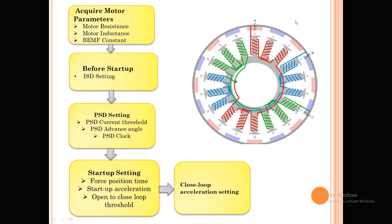All this activity is done in the PSD setting — Position State Detection — where we detect exactly where the rotor is inside the motor and which phase sequence is closest. We select that value, inject the corresponding current, and the motor starts smoothly.